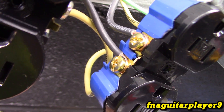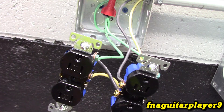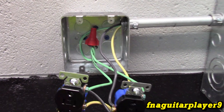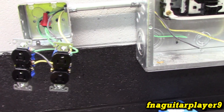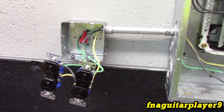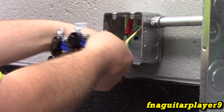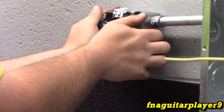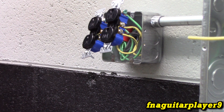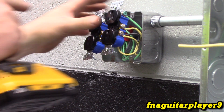On to the outlet wiring: white and black - I like to run these screws all in. I did cut the wire over here on those two just to use as pigtails. I went ahead and pulled the red wire out since there's no need for it here, though I can always feed another wire back through if needed. This will be one dedicated circuit - for the welder or similar - and the other circuit will be separate for the rest of the outlets. Fold the wire so when you press it in everything folds in. The code requires at least six inches of wire coming out of the box - I recommend more just so you have plenty of slack if you ever have to work on it again.